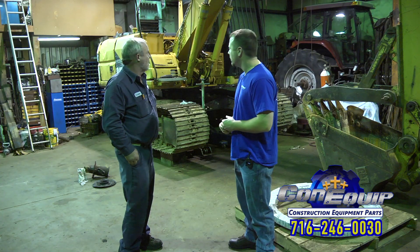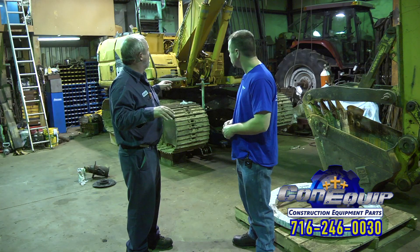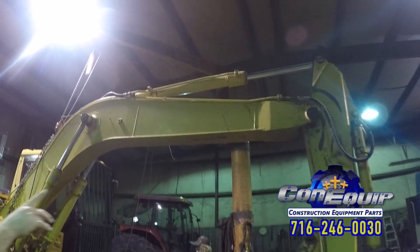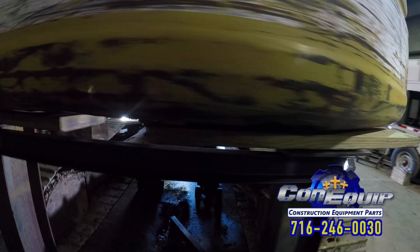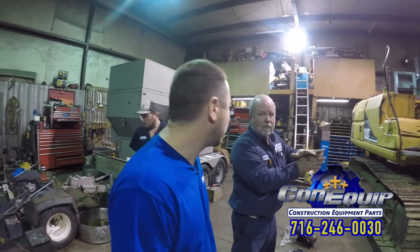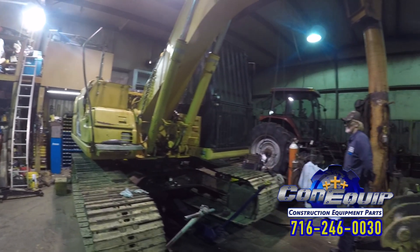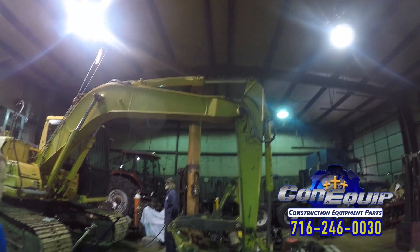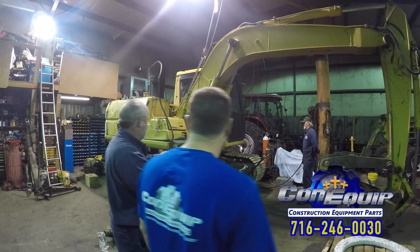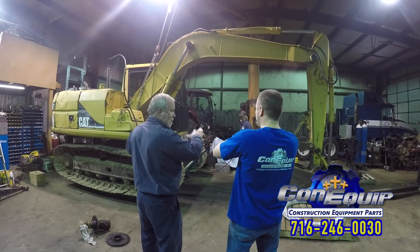With everything set up, we've got it jacked up, got it on blocks, got the machine on stands, and the overhead hoist is hooked to it just for safety. I've got two big stands back there — they're actually welded with a cross member so it's stationary and won't rock. One's turned sideways, one's turned forward so there's no rocking. The boom on the machine is holding weight, and the crane is hooked up just for safety so nothing shifts while we're working. The two big jacks are holding the carriage right in the center with all the weight on them.